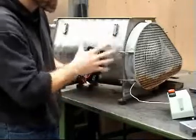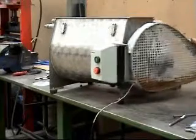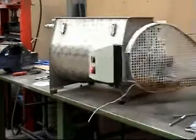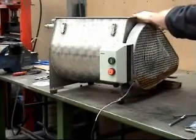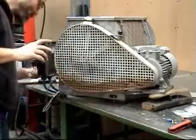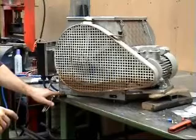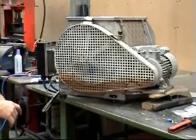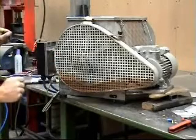So right, next thing is to mount it all and to run the wiring. Test run just to make sure that the door opens okay before we go wiring it all up and having to change everything. So we've got clearance on the door, we can get to the belt and nothing fails. Got the wiring done, run around with the meter, quick check. I've got a secure earth to the case for a safety feature. Got it held on by a pair of pliers at the moment, got a drill hole and put a nut into that. We're plugged in, so we're live, so a bit of a test.